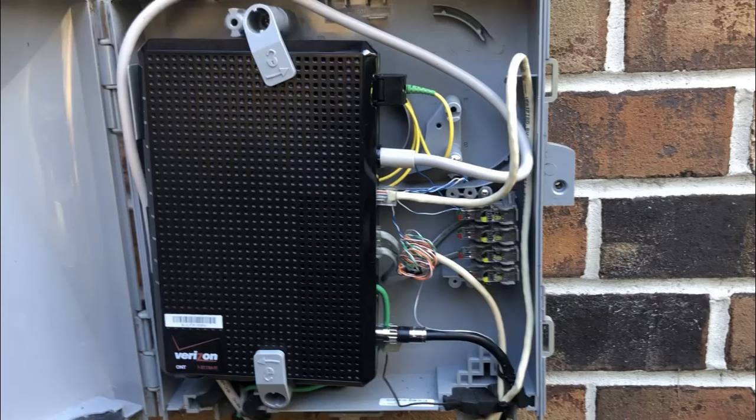That's basically the setup you'll find in most FiOS systems. However, if you do not pay for gigabit, there will be no CAT6 out — that port will be turned off on the ONT — and you will just have a coaxial cable going into your router, which can still provide pretty good service, but you won't be able to get gigabit speeds. Gigabit speeds are only applicable over wired connections anyway; with the equipment they provide, you don't get anywhere close to gigabit service on wireless connections.